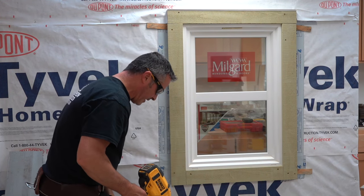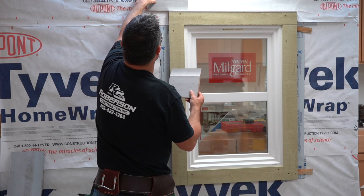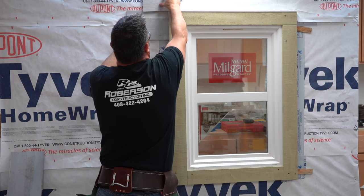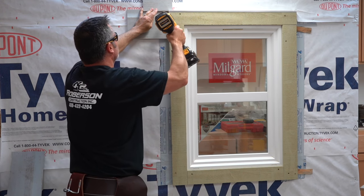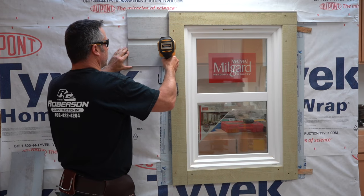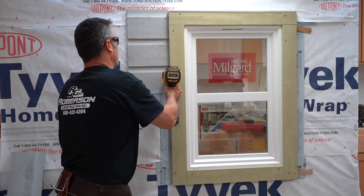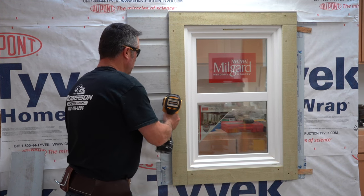With the siding, I'm going to show you along the outside where it touches. We're going to set this up so the piece on top just sits flush — set this first, bring it in. Normally you'd take this from the bottom up, but I wanted to show you how the headpiece is going to work. I'm using one-and-a-half-inch nails for this demonstration across the top piece.